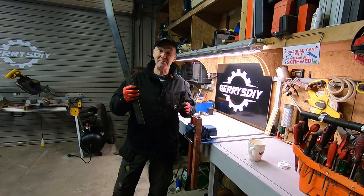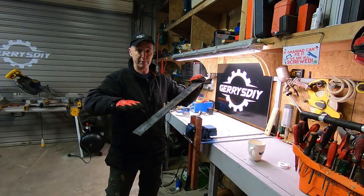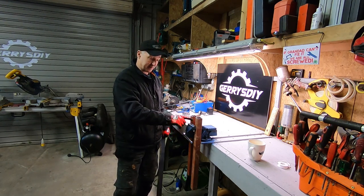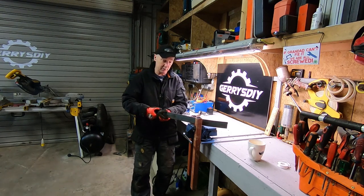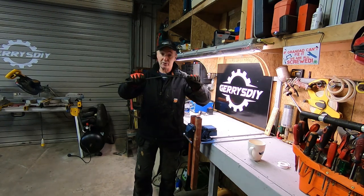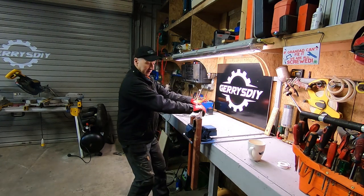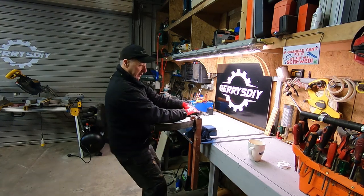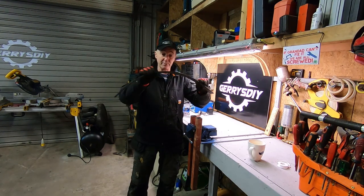I need to make another one of these arc parts. This is my 50 mil by 6 mil flat iron and I need to form the same radius as the drum. I'll start pulling a bend on it, offer it up, and adjust as I go. I've put some 40 mil box section in the vise so I can work a bit of a bend into it — a little bit more, bit more, and that's what I've done so far. It doesn't need to be perfect because I'm going to use the fiberglass rope as my seal; it'll take up any imperfections.